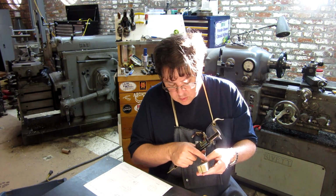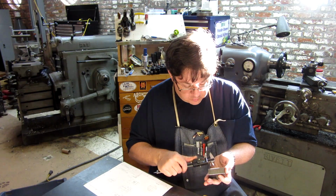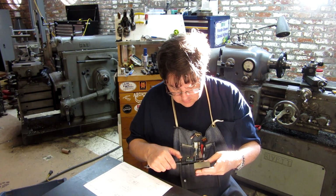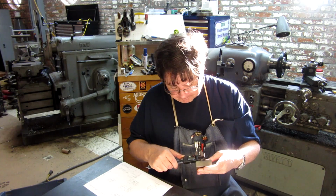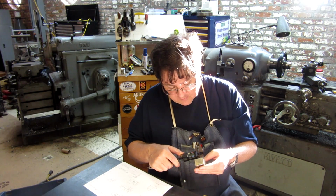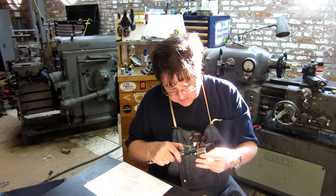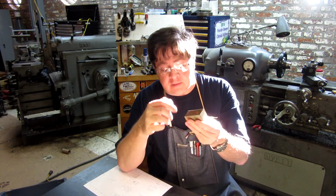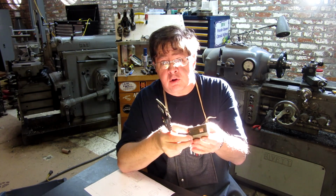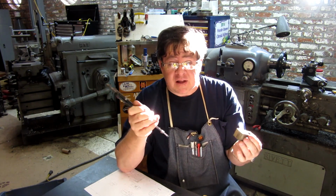The width of the square hole was .520. Let's see, let's measure the one that I haven't filed on. And I'm at .520 exactly. And the height of the front to back dimension on the square hole was .505, or .515, excuse me. And I am at .512. I have no doubt that when he cut this slot here, this long slot, the part closed up a little bit. Anyway, that's how I did it.